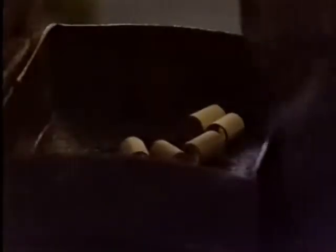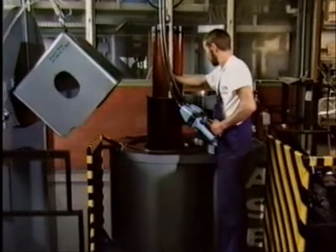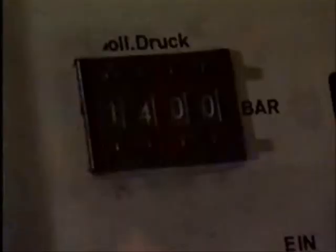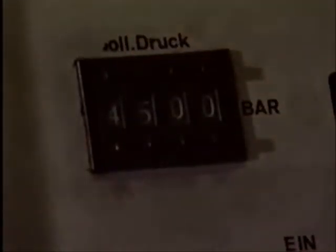Larger so-called filter candles and other tubular shaped porous parts are formed by cold isostatic pressing of spherical powders in a rubber mold against a mandrel at pressures of 45 to 60 kilonewtons per square centimeter. These are subsequently sintered in vacuum furnaces.